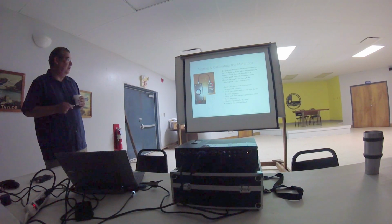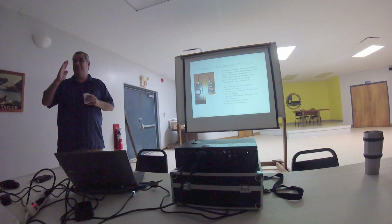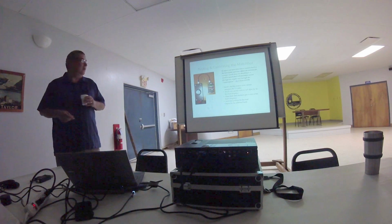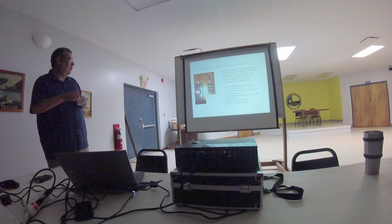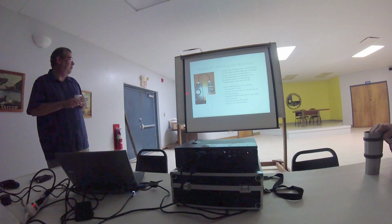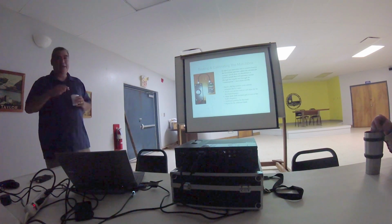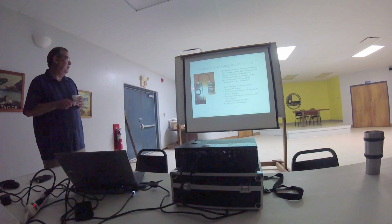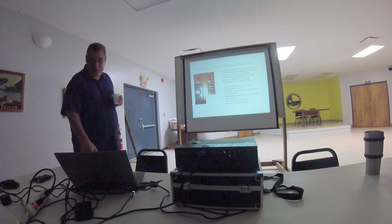You set the frequency of your antenna analyzer to where you want to zero it. And then you adjust this capacitor until you achieve a zero reactance so that you know that you're at resonance. And what I do is just put a little pencil mark or a little pin mark where the knob tunes in at that level. And then you just repeat it for each of the other bands. So I have the bands marked here, but I haven't really had a chance to test it out on some other bands. I've got this set up for 20 meters. But that's the basic procedure for setting up where the band position should be on this tuning knob.